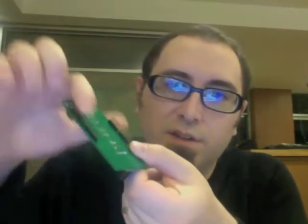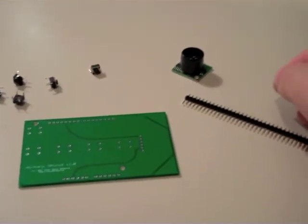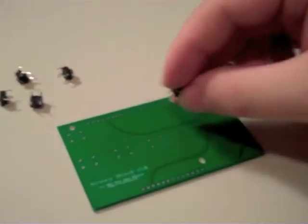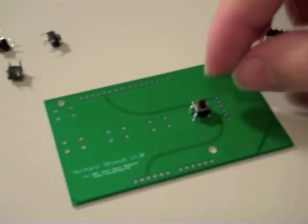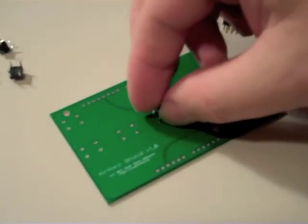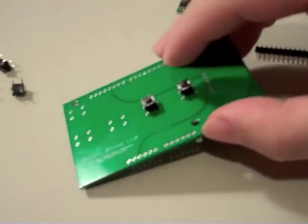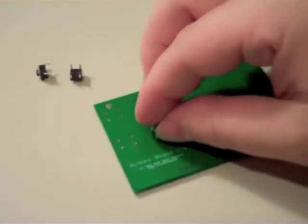So I will show you how to build this from a kit. All it is is just five push buttons, an ultrasonic sensor, and these little pin headers, and I will show you how to hook it up with the other components. Now we have our parts assembled and we can start placing them. These push buttons pretty much just go right where you would expect them to go. The four-pin header can really only go in one way — if you try to put them in the other way, the pin spacing won't match. So just put them in as you would expect, and they will snap in for a sturdy retention, and of course we will shortly be soldering them in place.